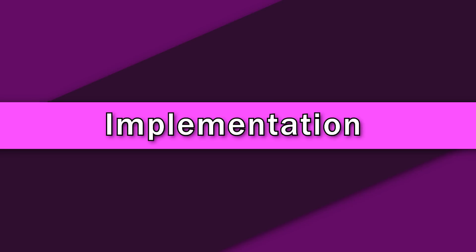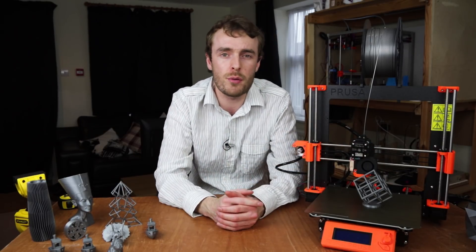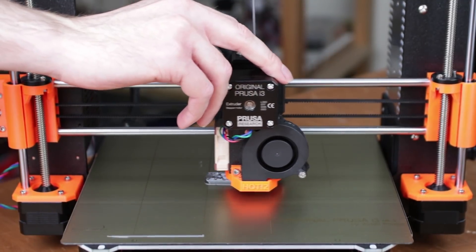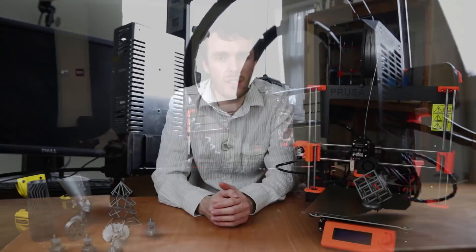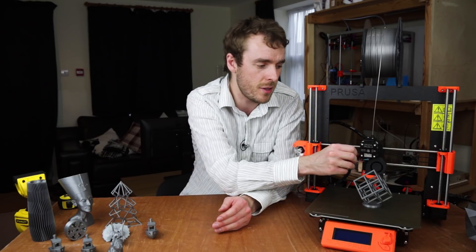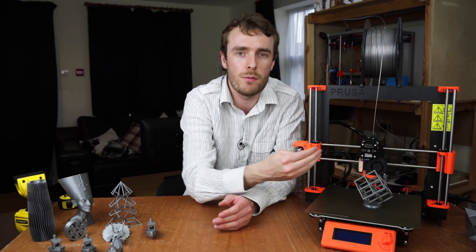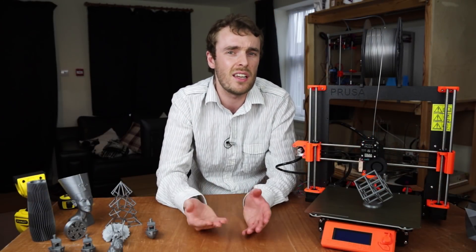So in the real world, how well does this actually work when you're trying to print something? From my experience it works very well. You can have it skip steps multiple times during a print and it does the recovery and carries on as if nothing ever happened, which is pretty fantastic. If you're trying to prevent skip steps as a result of resonance or something like that, then it's absolutely brilliant. However, if we're talking about crash detection, I'm not sure the implementation is quite right — if your printer is crashing in the middle of a print, hitting something on the rail, or a separate object has fallen on it, or it's curled up so much it can't move past a specific point, you don't really want it to keep trying over and over. I think when it's a crash you'd want it to try once or twice, and if it can't succeed after that, give up because it might start to damage something.